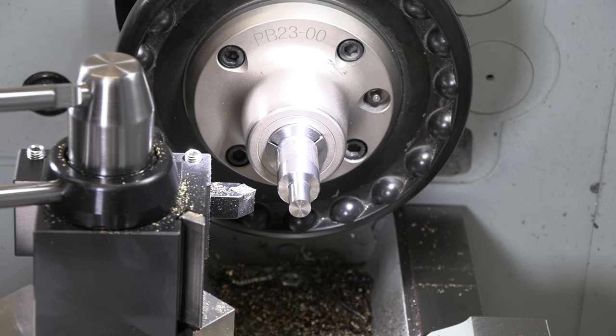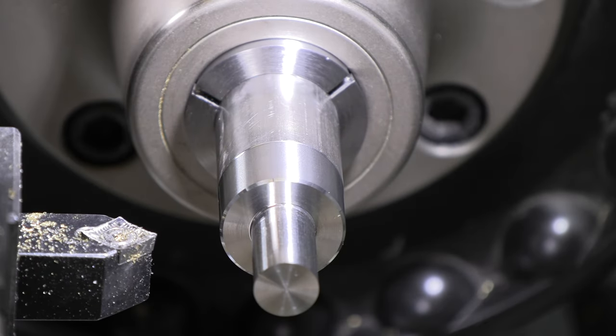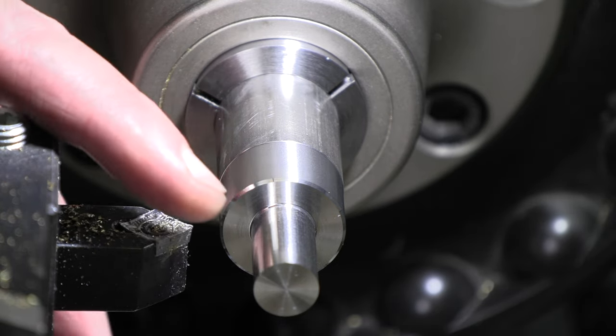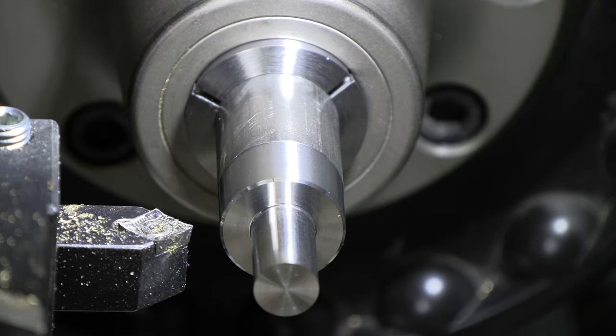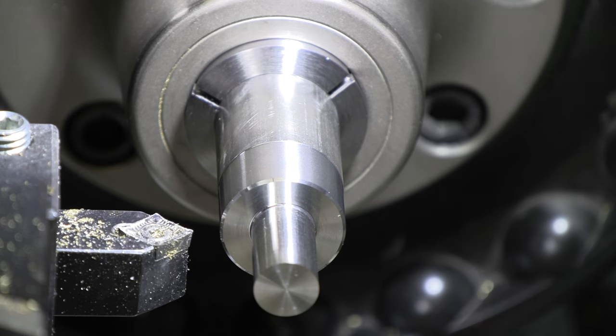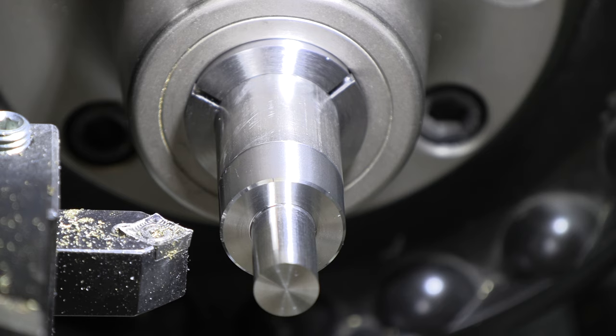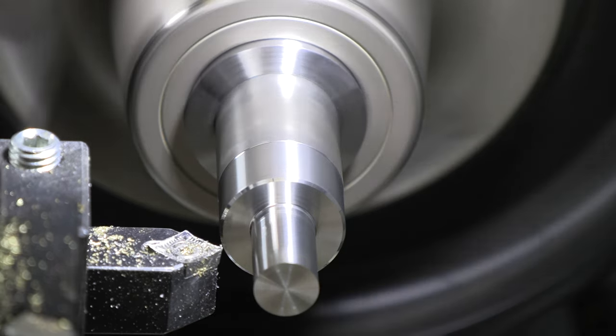I'm gonna try something. I've been looking to do a little decorative experiment here. So I'm running a really fast feed, 47 thou per revolution. I'm gonna go in here and take a cut and see if I can make a sort of cut knurl pattern on here. I'm gonna feed it across, change direction, and let it feed back at one depth, so I don't think it would line back up in the same groove. So I pretty much have to do it in one shot. I'm gonna go 30 thou deep as an experiment, and we'll see what this looks like.